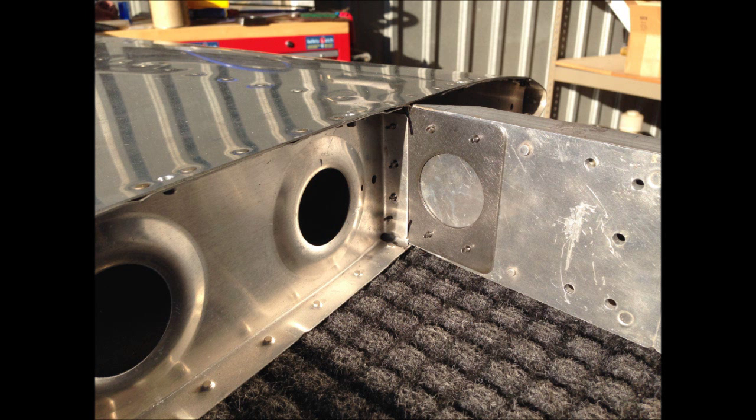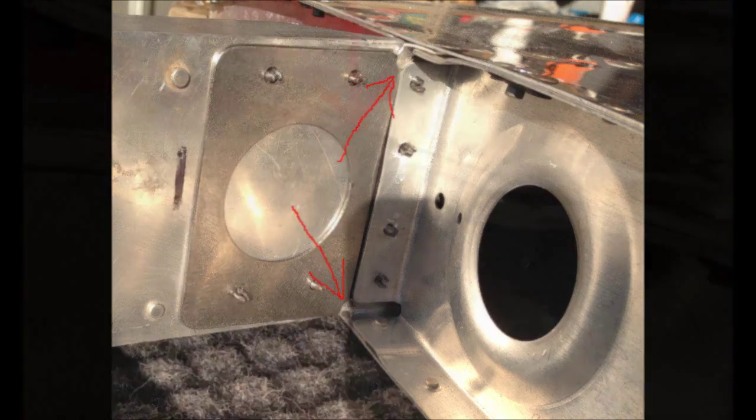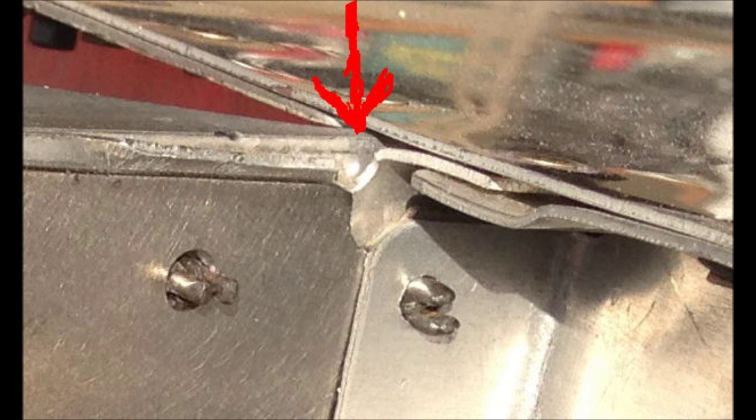The bottom line is: let's assume you've got a crack at the top and one at the bottom that have propagated and moved toward each other until they've touched. If this piece is spanning that crack and it's approximately four times stronger than the original material in that sheet on the back of the spar, it wouldn't matter. This part is so strong that you could, in my opinion, disregard it completely. Even if that piece cracked clear through, with this stainless piece over the top of it, that virtually can't happen.